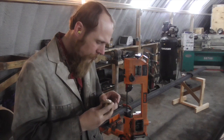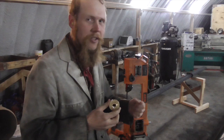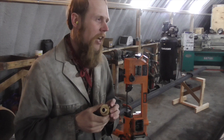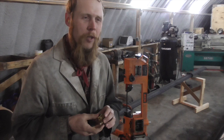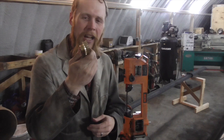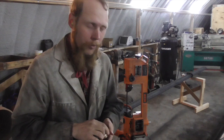I think that leaves me with only one option if I want to get this saw operational again, and that's to make a new worm gear from scratch. I'm going to attempt to do that today and I'm not sure what the probability of success is. I've never tried making a worm gear before, I don't have the right specialized jigs and fixtures, nor do I have any brass stock, so I'm going to make it out of aluminum — which is going to wear out even faster than brass would, if it works at all. But we're going to give this a try as a temporary fix.